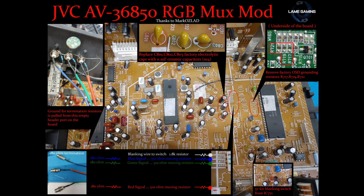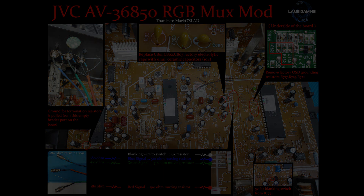So here is the mod. A 1 volt peak to peak RGB signal is obviously what works. But the way this jungle chip works, it injects the RGB through the on-screen display, deep enough in the circuitry where the on-screen menus for settings, brightness, contrast — all that will not function. You can only adjust it through the service menu, and you're limited at that. But luckily, 1 volt peak to peak and resetting my G2 to factory gives almost a perfect image. So let's carry on with it.